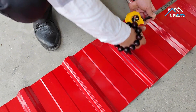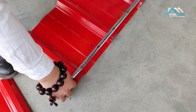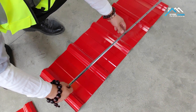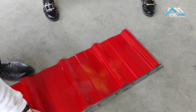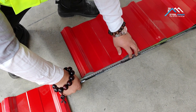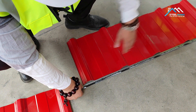All your measurements are here. This edge to this edge — you see, it's 840 width. If you want to know the full width, it will be edge to edge. It's 910. So 840 is the effective width, the covered width, and 910 is the total width.